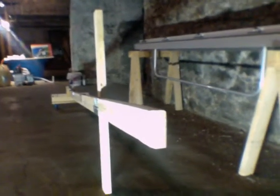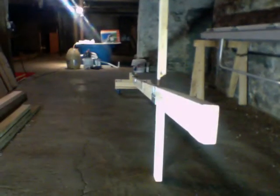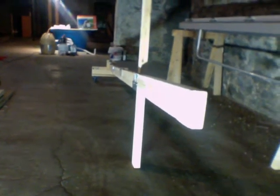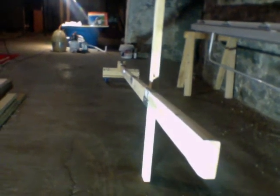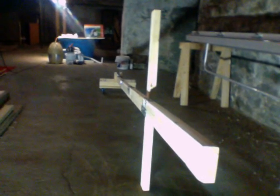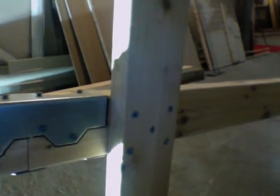I'm hoping this is enough to be clear about how it's to be assembled. In order to put the screws in, you can use soap on the screws to make them screw easier. These are three inch screws on this cross member into the main beam, and they go in at an angle to give it some torsional stability.